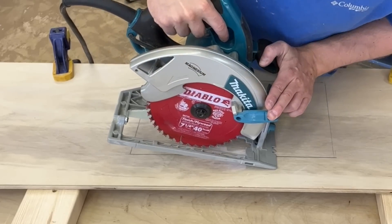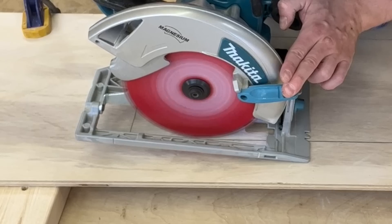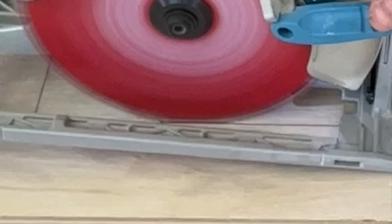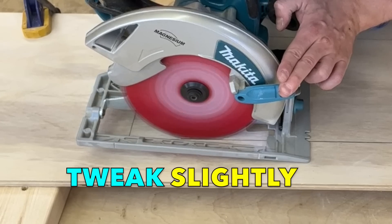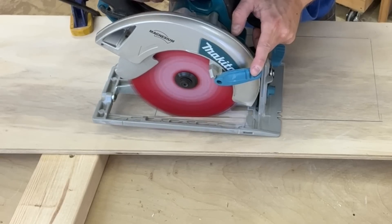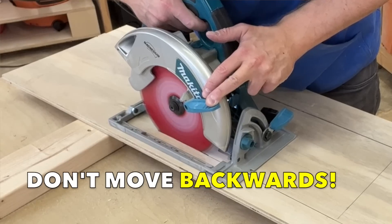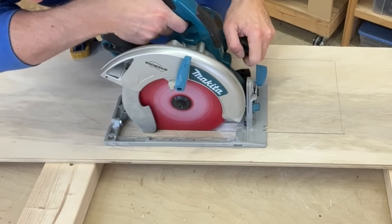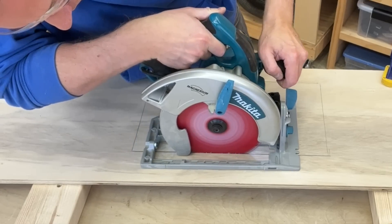Lift the blade guard lever with your free hand. With the saw stable at the front, pull the trigger and let it spin all the way up, but make sure that the blade is not yet in contact with the wood. Now slowly lever the saw downwards and watch the score line as it appears. Is it right where you want it, running perfectly parallel to the cut path? If not, you can tweak very slightly right now, making just the shallowest cut. When your lineup is good, gently lower the blade all the way into the material, keeping the saw stable and steady. Don't let it run backwards — you never want a circular saw to move backwards at all.